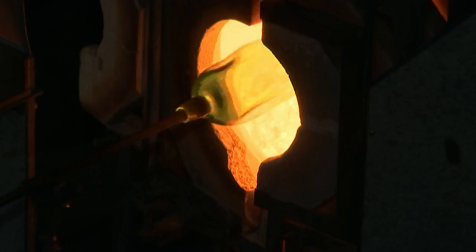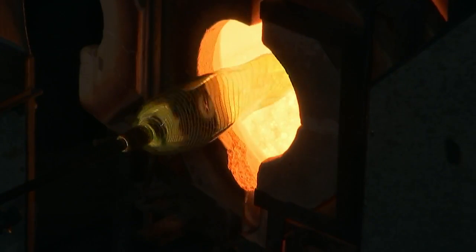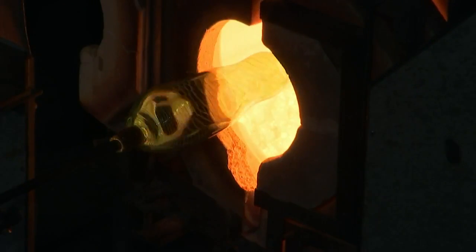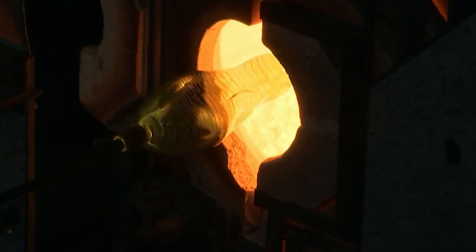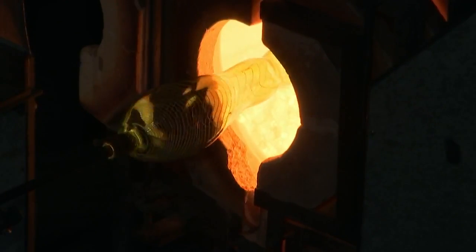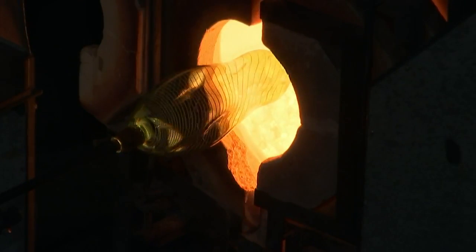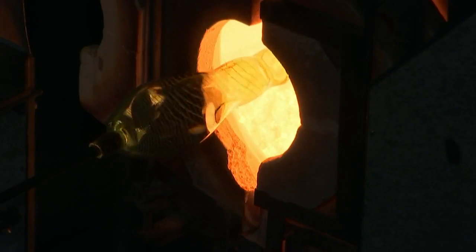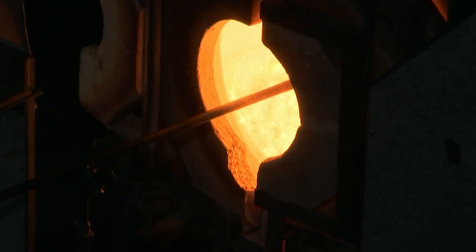To ensure even melting in our furnace, we will use a rake to push that mass of glass and ensure that everything's going to melt evenly and gradually. Now, we will continue to fill that furnace with 50 pounds, 25 in each barrel, throughout the whole day. So once we've reached about that 1,000 pounds, we will stop, but that will be going on throughout the whole day.